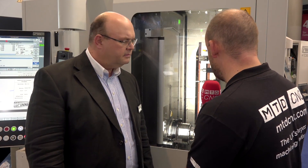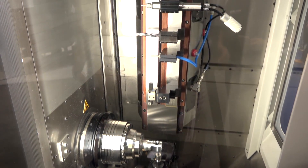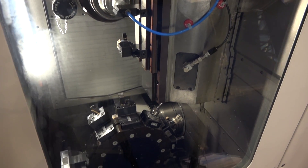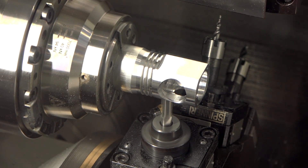What about how this machine is made up? We've got a turret at the bottom and then we've got a platen here — just tell us about the style. The gang tooling is obviously the place of the machine where you can reach the best precision because all the tolerances of the turret and the temperature of the turret are not involved. So we can do the micro finishing on the linear gang tooling. Because it's fixed, and we have only two axes involved. The spindle is moving in Z and X-axis — in two axes only — and we reach the maximum precision on this platen gang type tooling. But you can also move downwards with the spindle to the turret and make universal applications: pre-cutting and then finishing on top of the gang tooling.